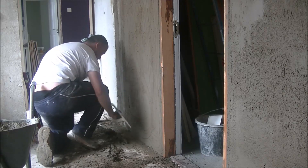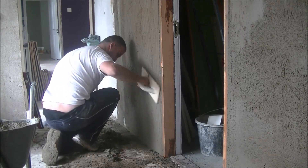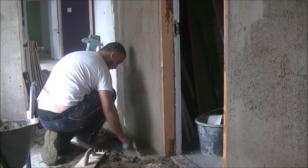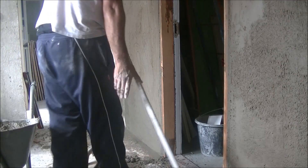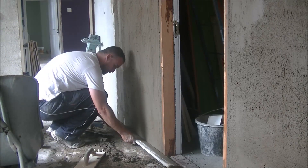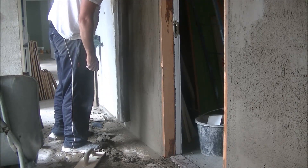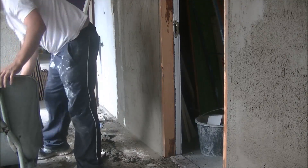Hopefully you noticed what I just did there — cleaning that door frame back with the back of the trowel, just scraping a wee bit out to allow my skim coat to go in. When working with these frames, try not to dig into them — most times they're just pine, a soft wood, so you don't want to damage them. The very edge of the door frame is going to be visible. Architraves always have a wee couple of mil around them. Clean your bottoms away as well as your tops. Give the wall a double check, make sure the skirting is nice and straight.